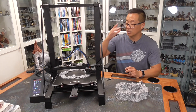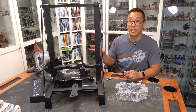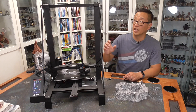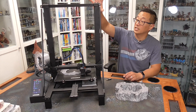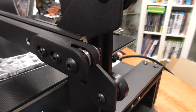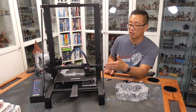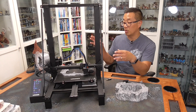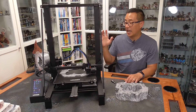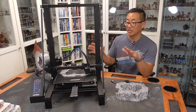Once I tightened up the build plate so that it didn't wobble and established the baseline level — which took me about 15 minutes — it's been printing fine. I've had no trouble with any build plate lift or any of the pieces not sticking to this glass bed. I'm really happy with this and love the fact that you have these stabilizers, just because this is so tall and long. I'm also glad that they have built-in belt tensioners for both the X and Y axis. This is an add-on you have to do with the Ender 3 if you want to. After a long time these belts do get loose and you need to increase the tension, but here it's built in for both X and Y. The only reason I have it as a giveaway to my Patreon supporters is because I already have three printers running and I don't have the space to keep this large machine.